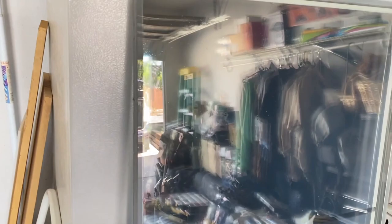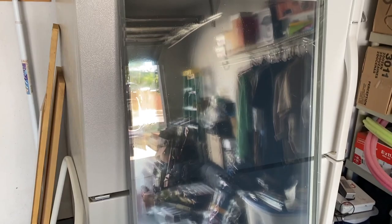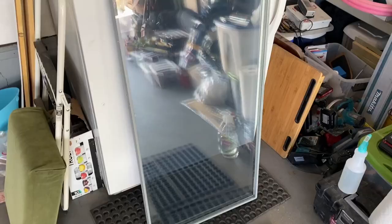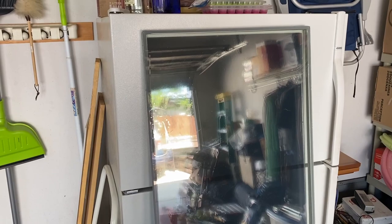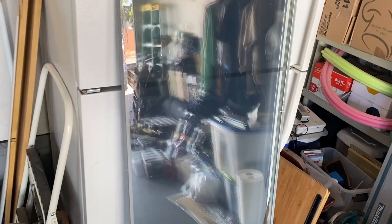This time I'm going to do it upright, here in the shade inside. Cut it rough size, then clean the glass really thoroughly. The film has a sticky backer — get it all prepped, then spray. Peel off the backing layer, spray that with soapy water, and stick them together. Squeegee it all out: go across the top, then down the center, and work your way out from the middle, squeegeeing out all that soapy water. Let it dry, and that's all there is to it.